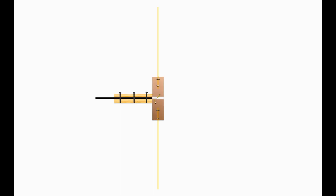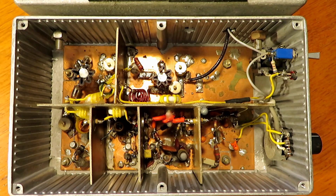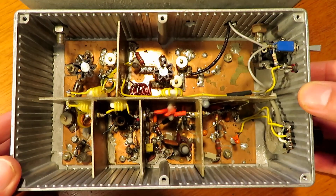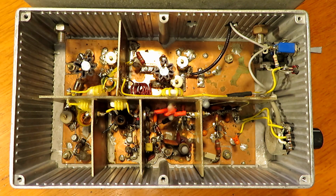Let's go back to Arthur's designs. Arthur's designs were classic old and sadly now rarely used circuit building techniques where the components are mounted in free space over copper board with relevant components tacked in and out of circuit as required. This makes for very quick assembly and most of this was actually done with no circuit diagrams on the table. He absolutely free-formed this - he knew these circuits off the top of his head, which was even more amazing to me.